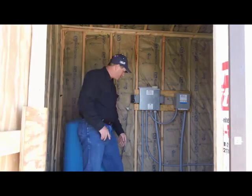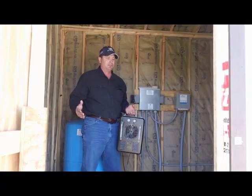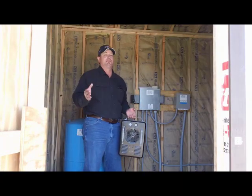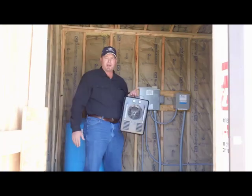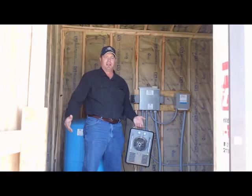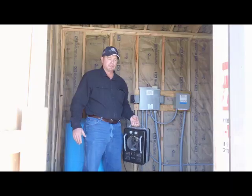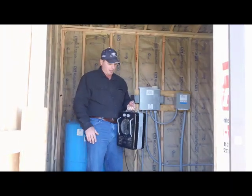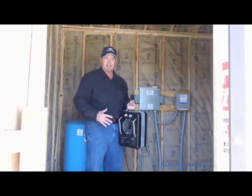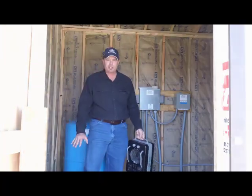The second is a heat source. I like to use a space heater. Some people like heat lamps, but a heat lamp is a light bulb — you don't know when it's going to go out, it can go out at any time. Get a cheap space heater, put it in your pump house. It produces a lot more heat than a light bulb and it doesn't go out on you without warning. Now there is a possible fire danger — you don't want it around anything that can burn. They can sit in the pump house for years and build up a lot of dust. So I like to hang mine from the ceiling. Don't get it down close to the pipes — they can get hot and melt the pipes.